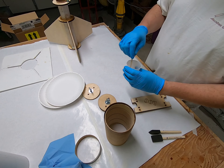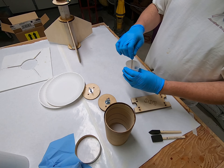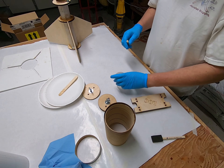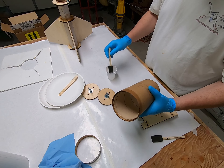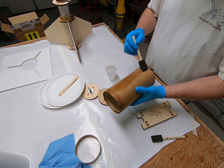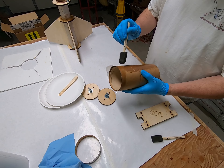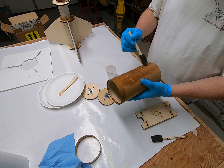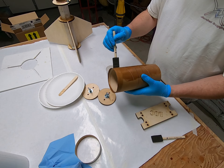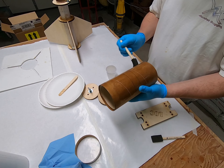We've got a small batch of West Systems stirring up here and this is slow hardener so we should have plenty of working time. We'll basically just paint it on. I'm kind of just working it in and rubbing it in - turns it into more of a phenolic kind of thing, the epoxy resin with paper. This kind of hardens it and makes it wear better.